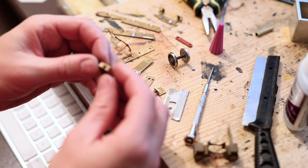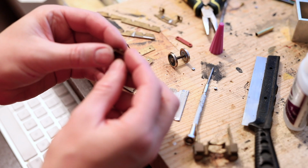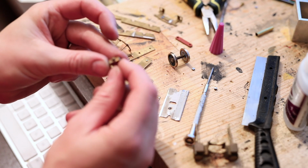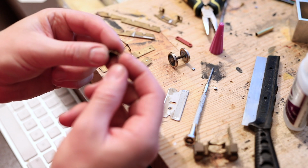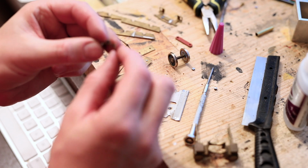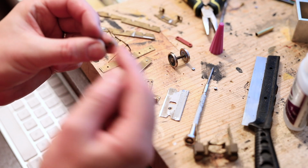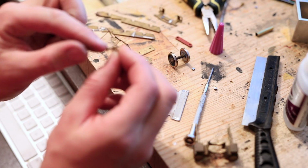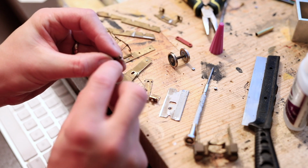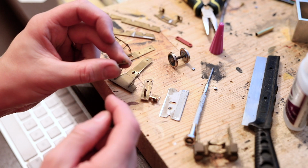About 2 millimeters on either side and just a little bit extra. Now this guy I haven't done yet. It's like these two. They're just the spacers. Kind of hold the whole thing together. This guy, I'm actually gonna flatten these and then re-bend them. I'm not gonna cut them because if I cut these off, then they're just gone. So I'm gonna flatten this so it's just one flat piece and hope it doesn't break, and re-bend them 2 millimeters in, and hopefully I get it right, and hopefully it won't break.